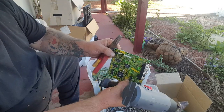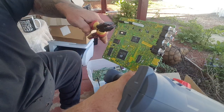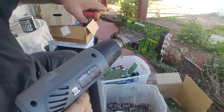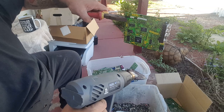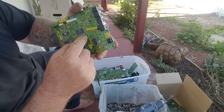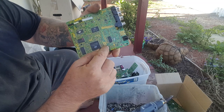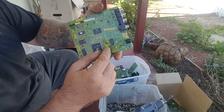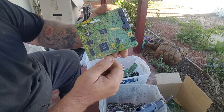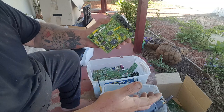A pair of pliers to hold on to my board. See I've got all these IC chips and so on. I can selectively pick out what I want and don't want. I just basically get it nice and close, move it around like that, heat it up until the solder melts and then they fall off. One of the advantages is when you're doing pins — there's usually holes in the board and the pin goes in the hole and they're soldered in there. If you've got a hammer chisel and you scrape them off and break the pins off level with the board, you're missing out on all that gold that's in the hole. Also, you're taking all the solder with it, whereas this way — you still get some solder — but because it's melted and you tap this on the side of the container, they fall out and a lot of the solder will just fall into the bucket.